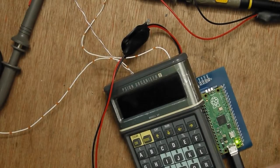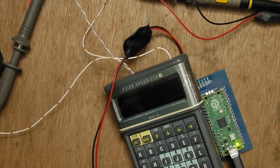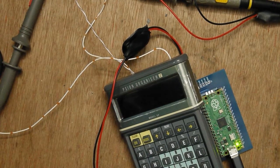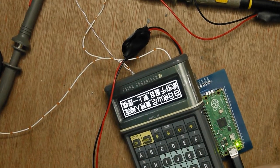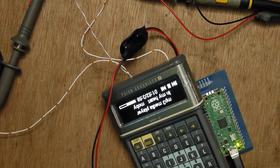After a bit of investigation, it turns out the I2C code, the display demo code, had a little bit of a timing issue, I think, and that meant that it would work okay if you had good signals and weren't running less than optimal signals on the I2C bus. So I've adjusted that and now I'm getting the demo display there.